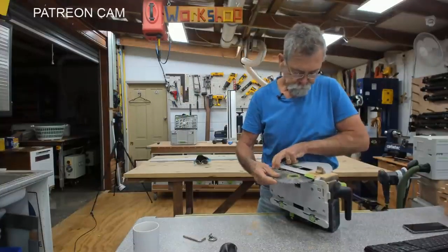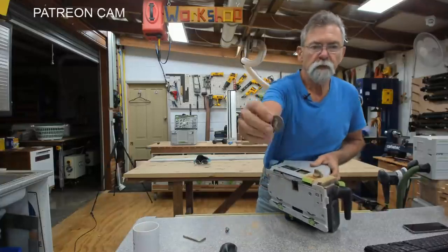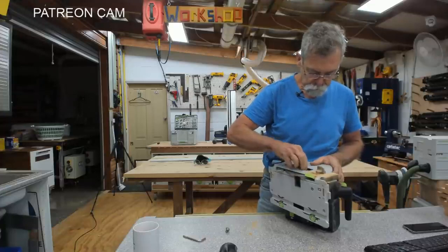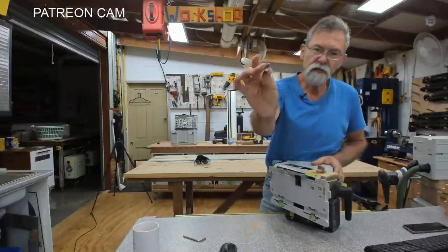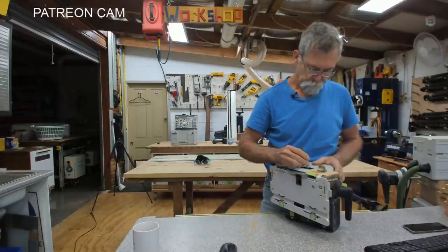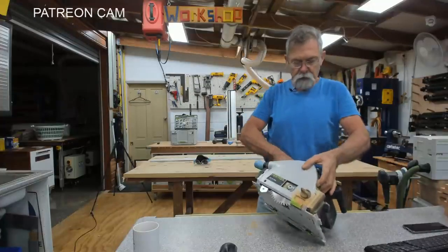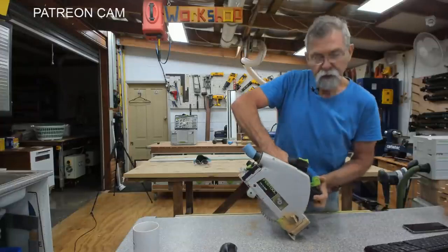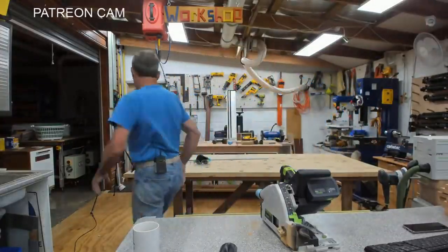Pull the riving knife up just a little bit. That's him. The washer or the flange has got little keys in it that drop into the right position. Got it. And then this is a countersink carriage bolt, I guess you could call it. Locks in. Nip it up. Put the Allen key back in so it's ready for next time. Hold it down and then release this little thing. Otherwise it goes clunk, makes a horrible noise, and you know, it's no good. So that's all set.